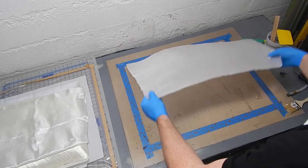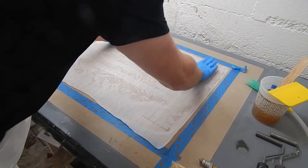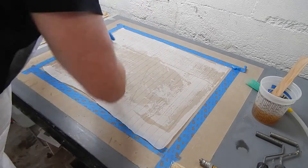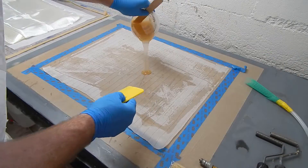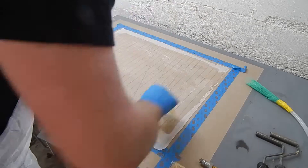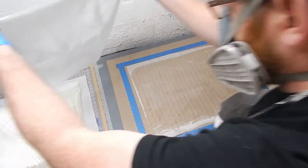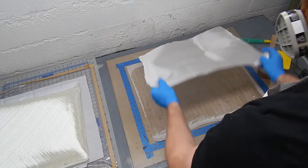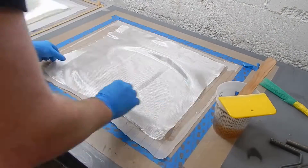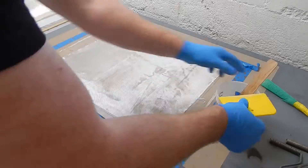I'm going to put a ply of peel ply against the tool here, just to show what it looks like. This is a nylon uncoated plain peel ply, and it'll be a nice way to see what that surface looks like. If you're going to make panels and glue them together, it's nice sometimes to have a peel ply surface on both sides. And the first ply here is a 6 ounce woven e-glass.